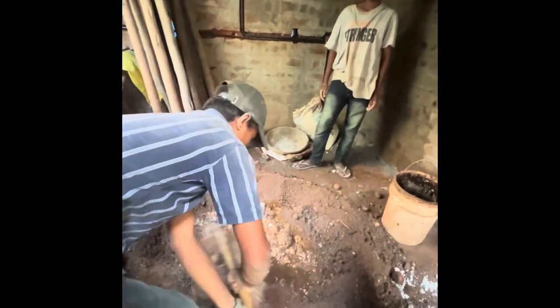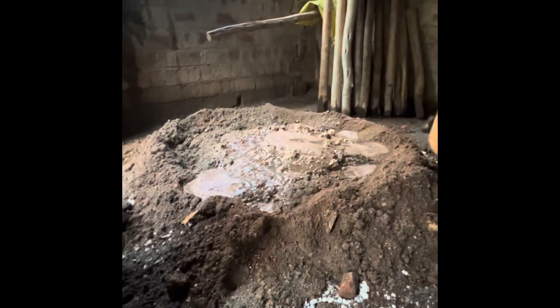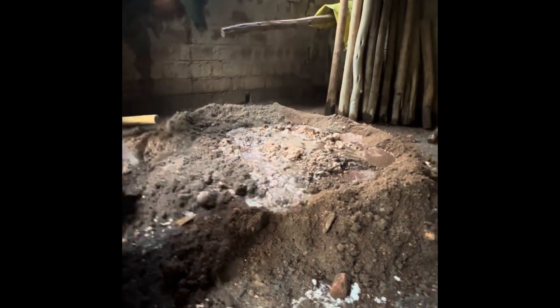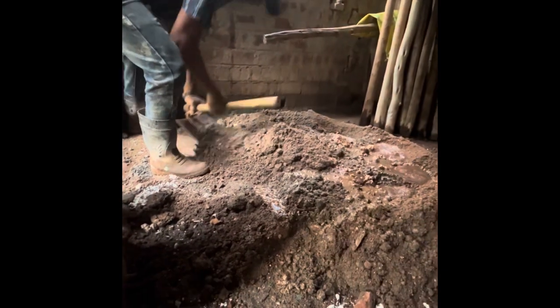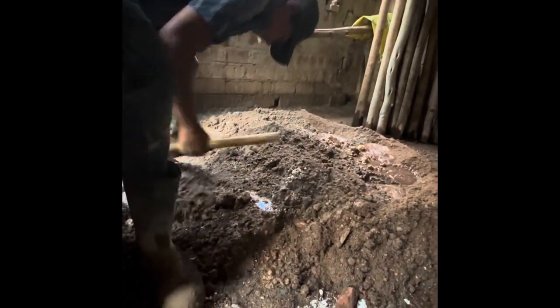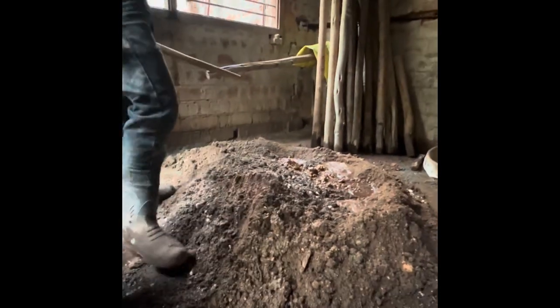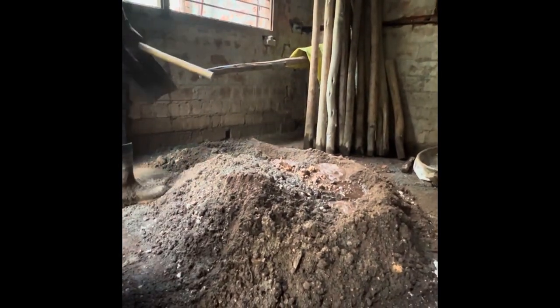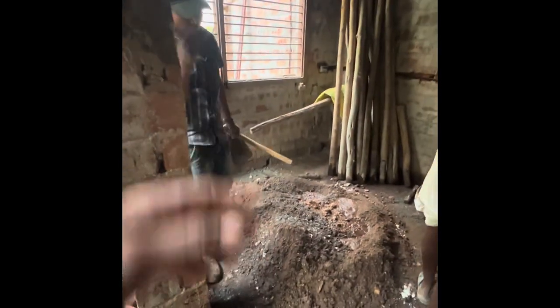So again, this also has our lime waste, we have our surkhi waste. While making surkhi, whatever wastage came in, and while cutting the bricks, whatever had fallen under the scaffolding, we took all that, we added more lime to it, some more jaggery water, some M-sand, and then yeah. And then Kiran, we start mixing it.